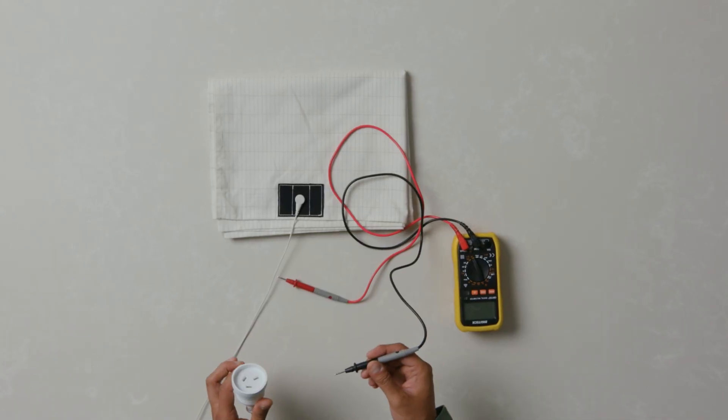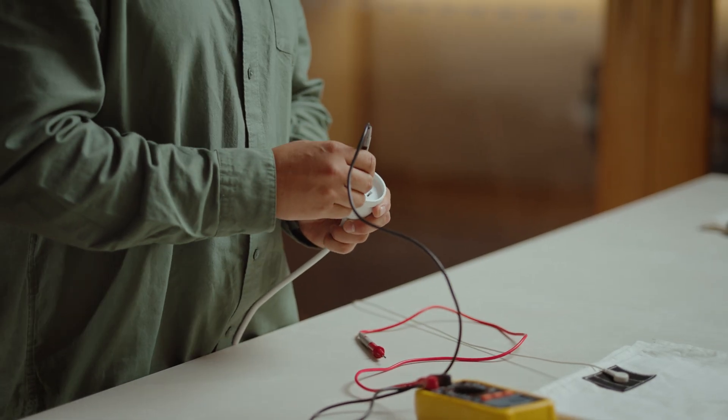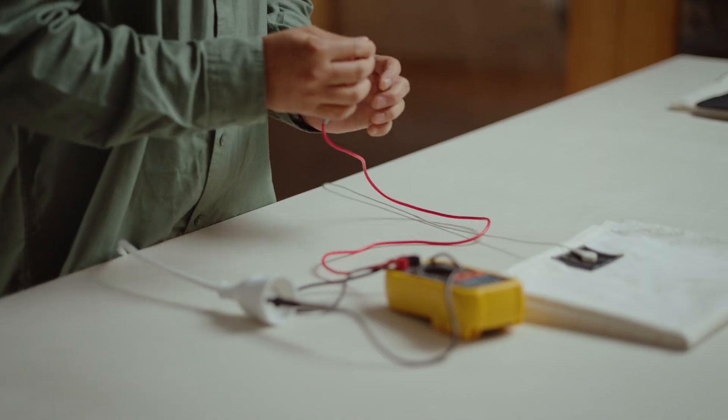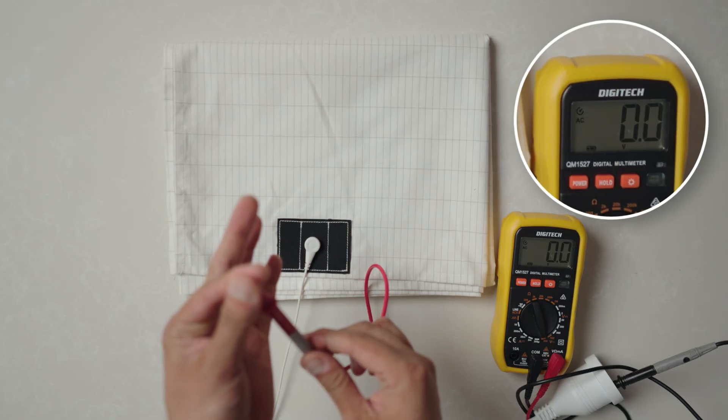Now I'll show you the other multimeter and we'll see that it's not a problem with the mat or sheet because it's the same setup. I've set everything up the same and I'm going to take the negative prong and put it into the ground outlet. Then I touch the red one and look — it doesn't show my voltage. So if it doesn't show my voltage, I can't proceed with the test. That's just to show that it's not your grounding mat or sheet that's faulty — it's actually the multimeter you're using.